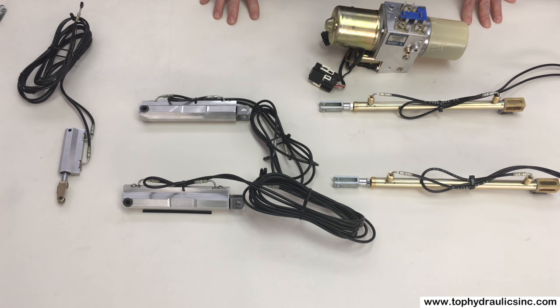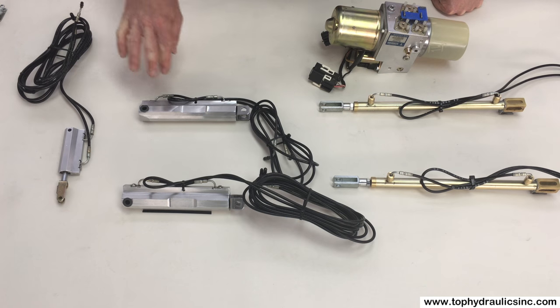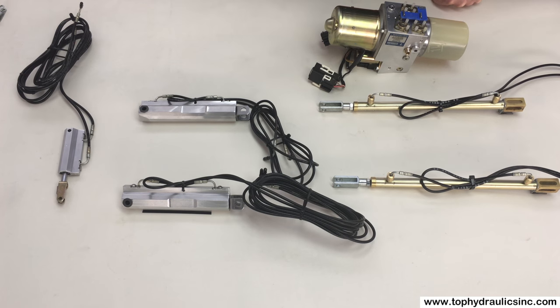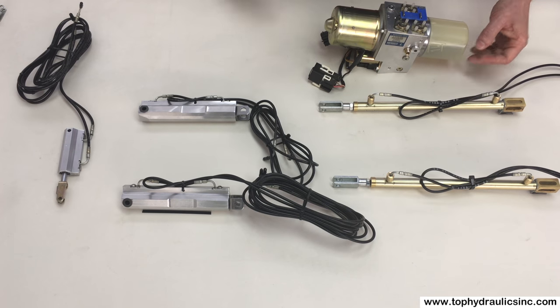I hope this gives you a good overview of what can go wrong in these hydraulic systems. The seals in these cylinders typically last about 15 years. If you live in a hot climate, the seals will decay faster; in a cool climate they could last a little longer. On average, the life expectancy of these cylinders is about 15 years. In a hot climate such as Florida, Texas, or the United Arab Emirates, these systems can easily fail after eight years. Also, what will make the systems fail sooner is the wrong fluid — if you have Stop Leak additives, they will soften seals, initially make them swell up, but then they fall apart quickly.